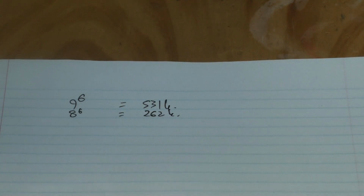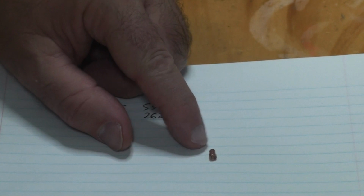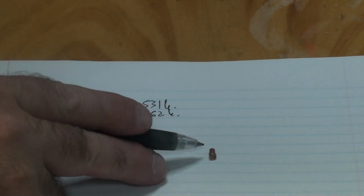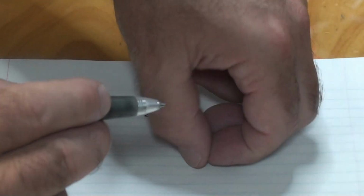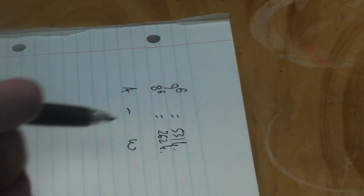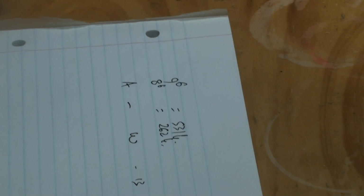you will already have figured out, I guess, that with these amazing little double-bitted key pins, you can get far more possible combinations. And it turns out that there are 13 possible key pin lengths of these things. So Assa, being Assa, they call them by letters and not numbers. And the letters are between A and W, so a lot of letters aren't used, but they have a total of 13 of these things.